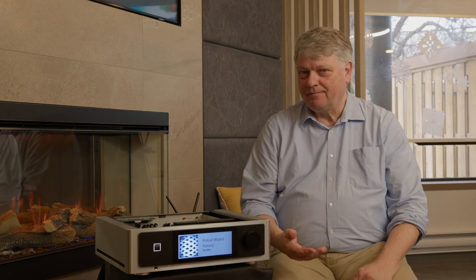We also have a very high quality phono stage with separate inputs for moving magnet and moving coil cartridges. Being a pure analog amplifier, we've taken particular care of the phono stage, which consists of both an MC moving coil and MM moving magnet section. The utmost has been done to keep signal-to-noise ratio as high as possible, so it also incorporates an infrasonic filter.